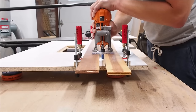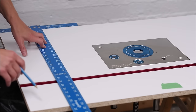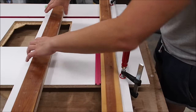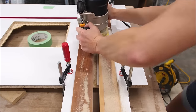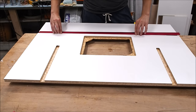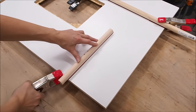Just a little note: it's not the best idea to use your trim router like I'm doing here — you'll need something much more powerful to cut a dado into melamine. Unfortunately I learned the hard way. Next, I'm marking out the tracks on the backside that will hold down my fence, positioning them about six inches in from each side. I was a little scared to cut the aluminum track but it cut really smoothly. I repeated the same process, clamping down my fences and using a piece of tape to mark a stop so I wouldn't go too far. After a dry fit, I used some weld bond glue — which is supposed to stick to both particle board and metal — to glue down the tracks. I used a dowel to help clamp them down and let it dry.